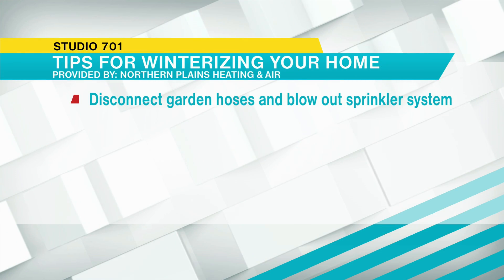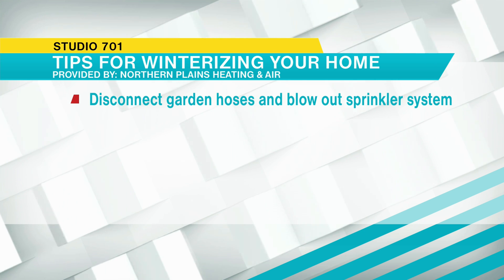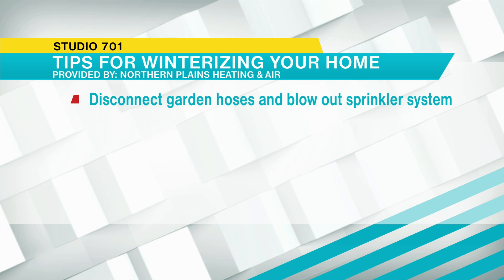We should start prepping for winter now. It's kind of sad we're talking about winter around the corner when we just had a hundred-degree days a couple weeks ago, but that's the seasonality we live in. It's very important to disconnect your garden hoses from your outside hydrants because those will freeze and break quickly. Frost is coming around the corner, and you won't find out they're broken until you turn them on in the spring to wash your car. You also need to blow out your underground sprinkler lines so those don't freeze and break and create havoc outside or inside your home.